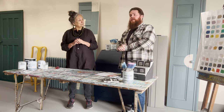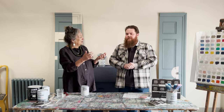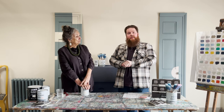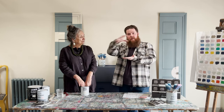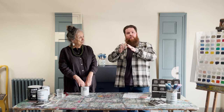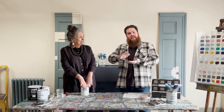It will self-level to a nice smooth finish. What does that actually mean? Technically, it just means the paint relaxes just before it dries. The paint dries from the surface up, but it stays open a little bit longer to relax. All the brush strokes you make will relax back down to their natural level. You don't have to overwork it — it will self-level if it has enough paint. Hence why we don't want you to overwork it and make it really thin, as that stops the self-levelling.